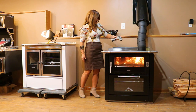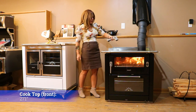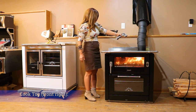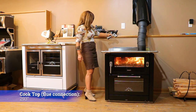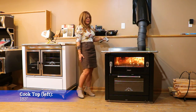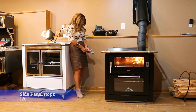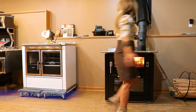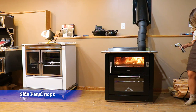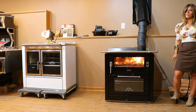Here are the medium temperature readings: center cook plate is at 608°F. Front of the stove: 271°F. Front corner: 232°F. In front of the flue: 293°F. Over the other flue hole: 576°F. Back area: 183°F. Left side panel: 120°F at the top, 88°F at the bottom. Right side panel: 136°F at the top, 85°F at the bottom. Those are our medium temperature readings.